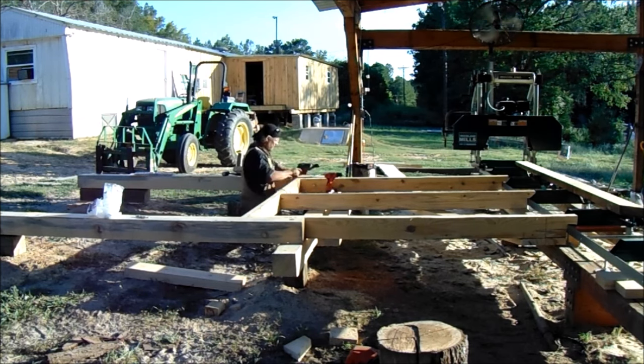As you can tell, we hammered this all the way in, so it's flush. Now this little joint here is rated at, I think, 4,500 pounds, what it shows. Of course, this is rated for 1,000. That deck don't weigh nothing like that, so we should be good. I think the winch is rated for 2,000. So that's gonna be our setup.